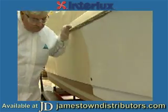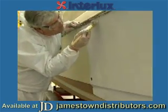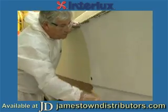Move to the next section and roller and tip off with a brush in the same way. Along the overlap, quickly work the brush horizontally over the surface to merge the layers together, then lightly tip off with the brush vertically to finish.